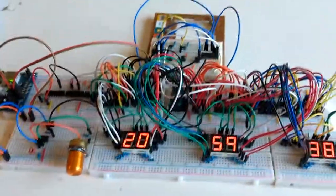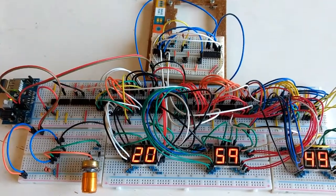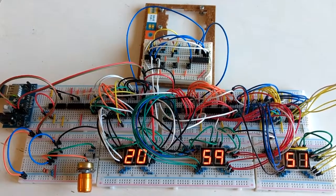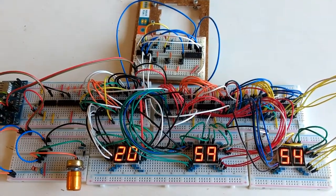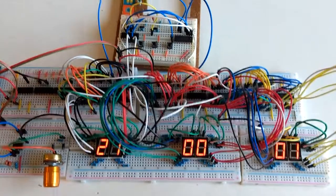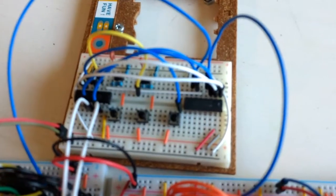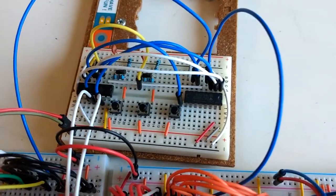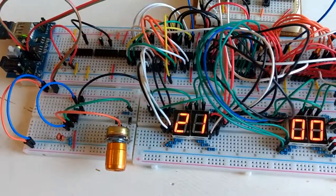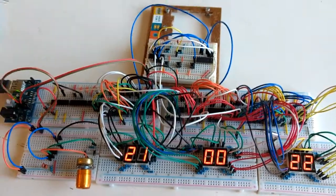In summary: a digital clock driven by a quartz crystal, converting to a 1 Hz signal that runs through a series of decade counters and display drivers for seven-segment displays, with a manual control panel to overwrite counting and set the time manually via clock pulses, and finally a pulse width modulator for display brightness control. And no microcontrollers.